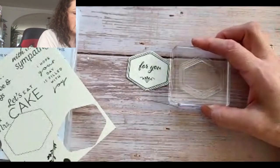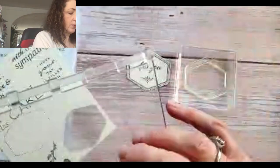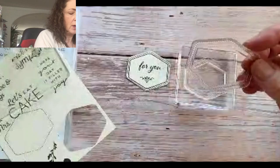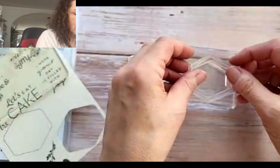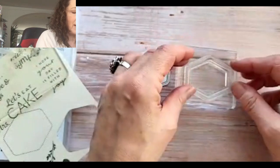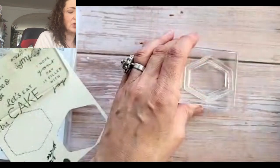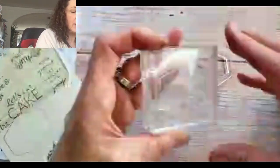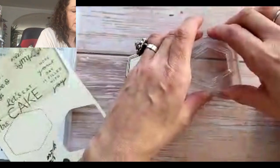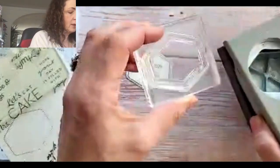This is the right way — this is how you pick up your stamp. The wrong way is to take the frame stamp and lay it on your block directly. You might do it well, but you might accidentally manipulate it one way or the other, and then it won't fit well into your punch. So you need to lay it down flat first and then pick it up, and then the shape will match the shape of the punch.